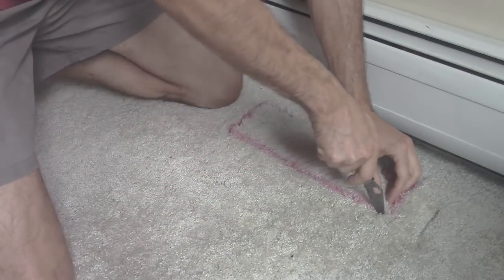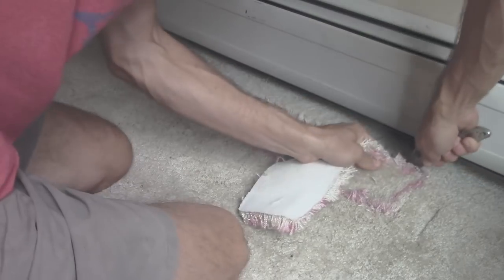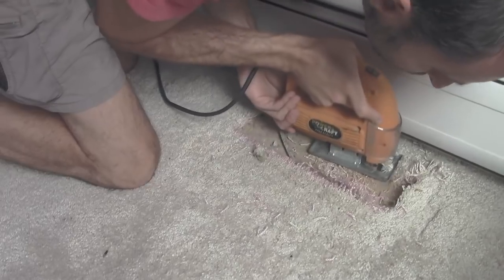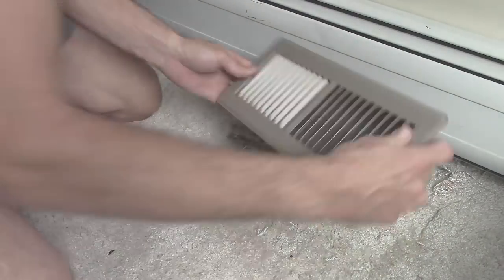Once I got them laid out, I used a red crayon for marking up the floor, which was kind of neat — you're not allowed to go drawing on floors as a kid, but I got a nice clean mark of where this thing is going to go in. Next step is using a knife to cut away the carpet and the pad under the carpet, and once I have that cut out, I'm going to drill four holes in the corners. Once I have the four holes drilled, that will allow me to use this jigsaw to connect the dots and cut out the piece of wood. These floor registers are made to just set into the floor — gravity is just going to hold these things in. Once I have that accomplished, I'll be able to light a fire and see how they work.